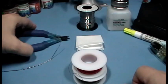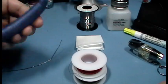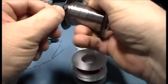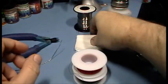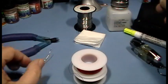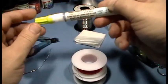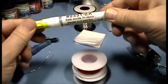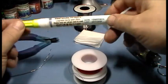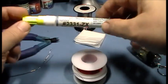I thought I would start off by talking about the tools and materials I'm going to be using. First I need a pair of diagonal cutters to cut and trim the wire to length. I'll need some solder — I'm going to use solder with a flux core in it. I have a wipe, just a paper towel or Kleenex, to wipe off the wire as I go. I have a flux pen. The flux will add to the flux in the wire solder, which helps promote wetting and removes oxidation.